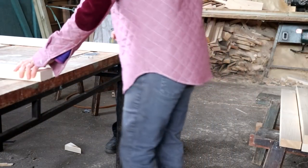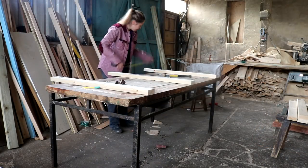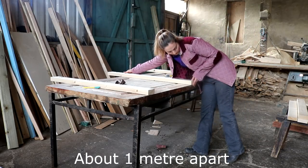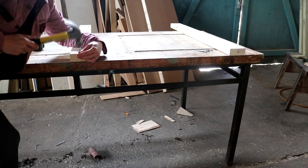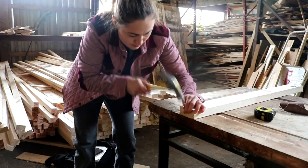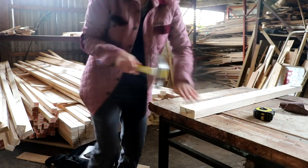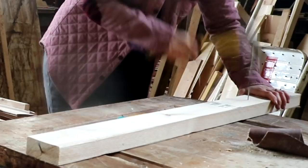I got designated to this table, which was extremely useful — better than decking at home. He told me to evenly space out the spars on the table, make sure everything was squared up, and fix them to the table temporarily with some nails to stop any movement later on. This table was the perfect template. I hammered in nails on an angle at one end and the others straight down, but not all the way because we want to remove them later.